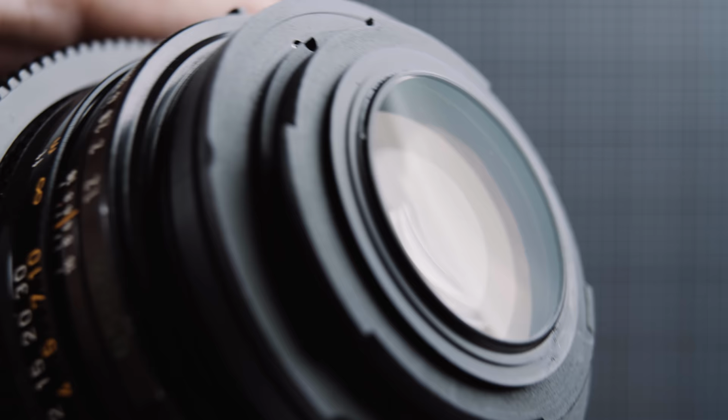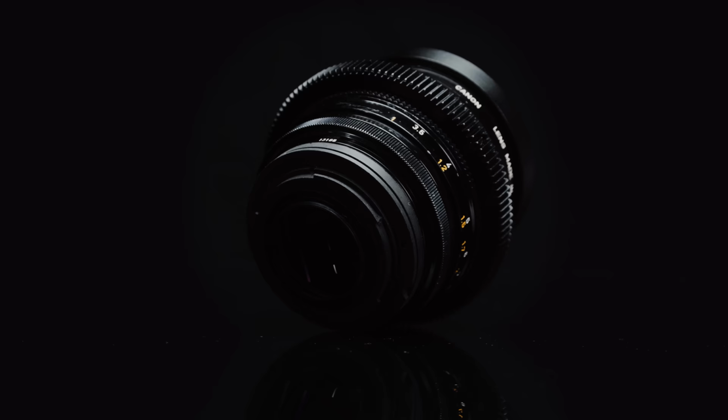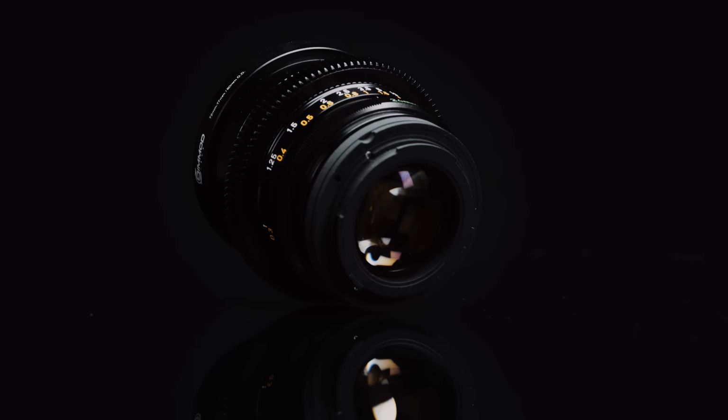The extreme high speed of the aspherical requires a short flange, and that means that the optical elements of the original mount are already inside the mount. And this is why the mount exchange on these lenses is especially difficult. Irreplaceable parts can easily be damaged. And that is why it should be handled by a professional service like Simmod to begin with.